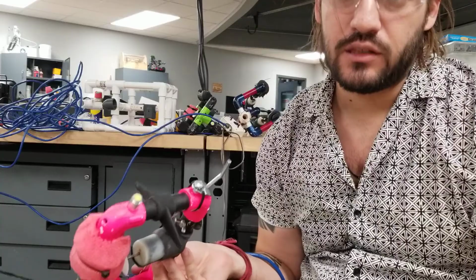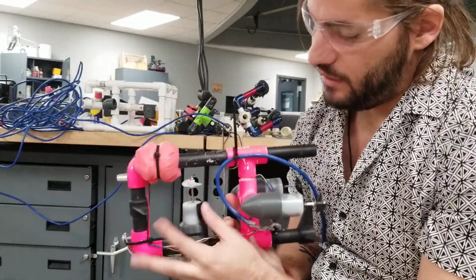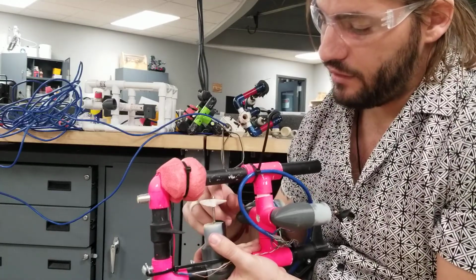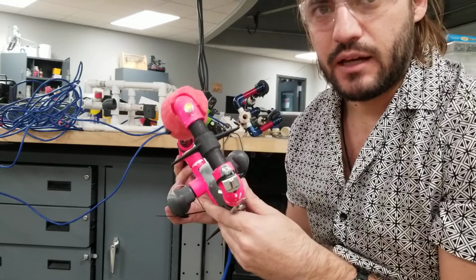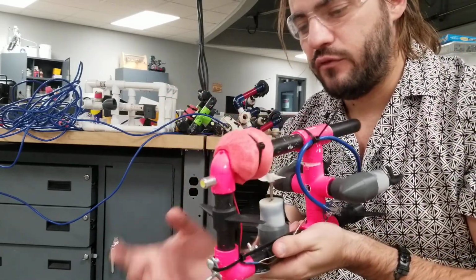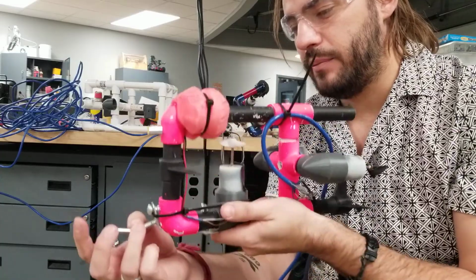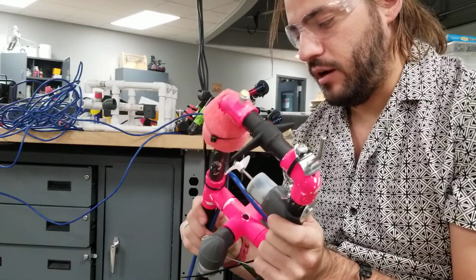You'll notice that when you get smaller and smaller designs, the more unbalanced you get. Now, one thing that's probably not very good about this design is that this bar right here is impeding the propeller that makes it go up and down in the water. So you probably don't have much upward force. This can be an issue because sometimes when the Seaperch tries to pick up a ring or a cube, if it doesn't have enough force, it actually can't pick it up. It might get around the obstacle course just fine, but when it comes to actually picking up, it doesn't have enough uplift to get it up. I've seen that be a problem.